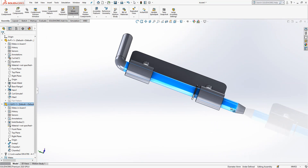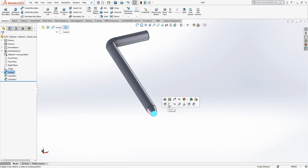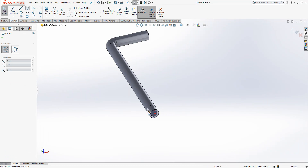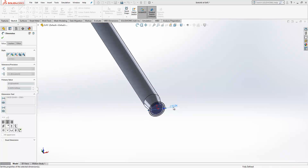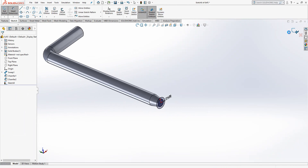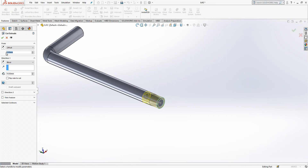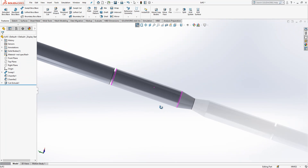Insert components — lock washer — drop it here. I select this face and make it coincident. I'm going to open this part. I select this surface, create a sketch, first convert the outer diameter, then introduce the internal diameter which is 4. Extrude cut — I will say an offset of 29 on this side and a cut length of 0.75.